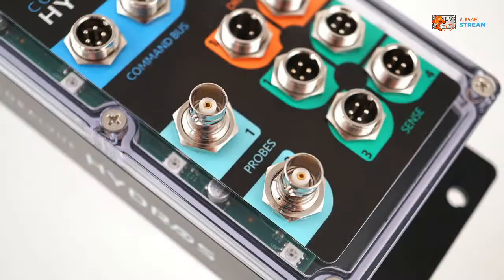The next port the controllers have is the probe port. And I think that's one of the biggest misconceptions - that a sense port and a probe port are the same. That is not correct. A probe port is for two things only: a pH probe and an ORP probe. That is it. Nothing else works in that probe port, to make it clear.